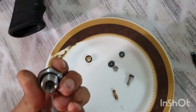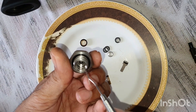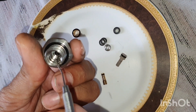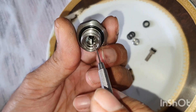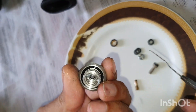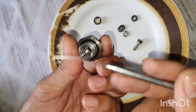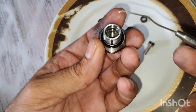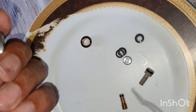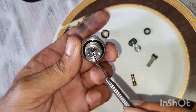Here is a very slight groove — here is a groove. So here in this cavity, where the tail of the piston enters, there is a groove inside this cavity, a tiny groove, and there is a 4mm x 1.5mm O-ring inside this groove. This groove cannot be seen by the naked eye and neither has it been given in the website diagram. This O-ring had gone bad. In order to fix the regulator, since there was no clue about this O-ring, I had to open the whole reg a number of times and replaced all the other O-rings and even the piston, but nothing worked until I found that there is an O-ring here in the groove.